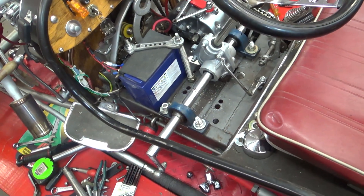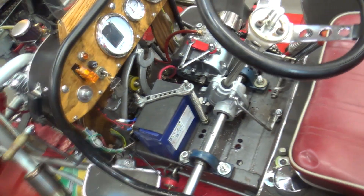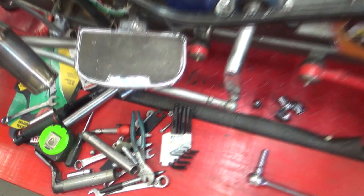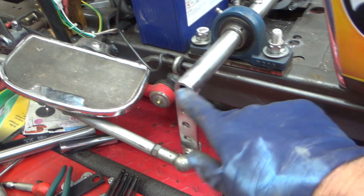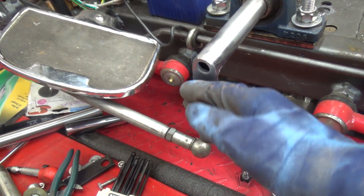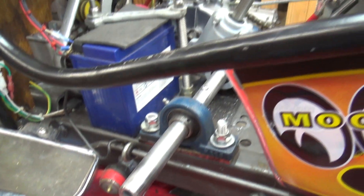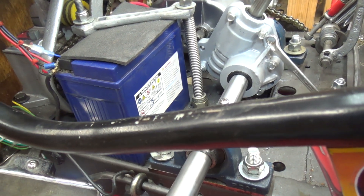The steering is kicking me, but it ain't going to get me down. I've got it set up now so that it will work. I eliminated one of the problems I had with the electric steering box, where I had to have this bar pointing up and as a result my tie rod was coming out and around the outside of the exhaust. This is back where it was originally, because with this having a shaft coming out on either side, all I had to do is flip the box to get it to rotate the way I wanted.